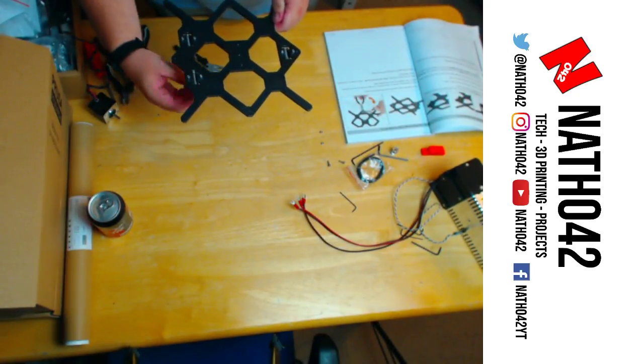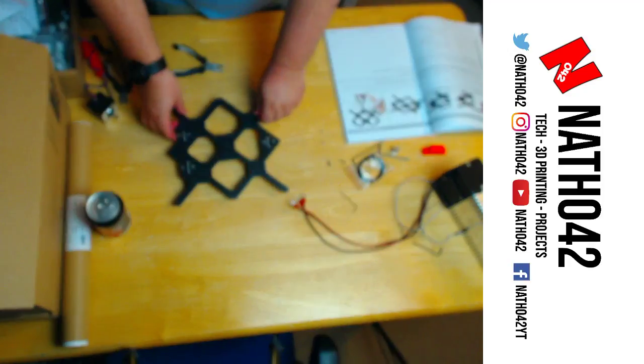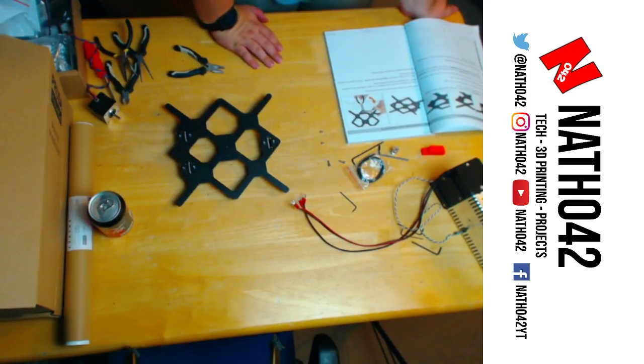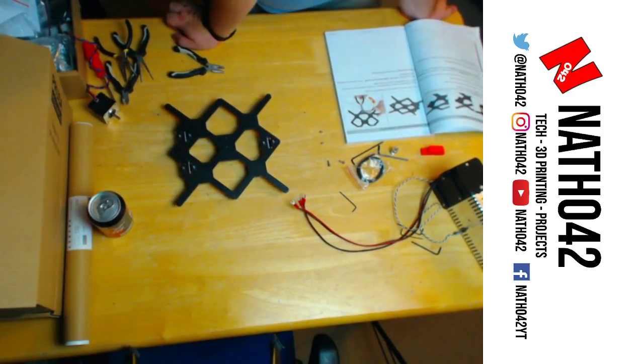There, you got a slight rattle like that. So that is... Ensure you're tightening both nuts equally. Oh no. As soon as you reach the surface, stop tightening. We will finish tightening the nuts in the next step. Ensure again the nuts are tightened just to the surface and equally. Check if the bearing is centered in both directions. If not, slightly release the nuts and adjust its position. Then retighten the nuts to the previous state.